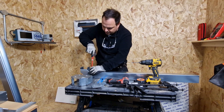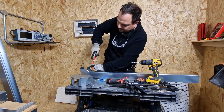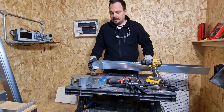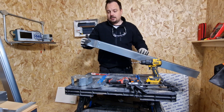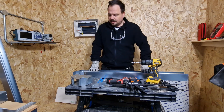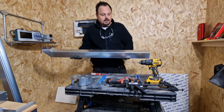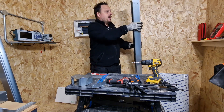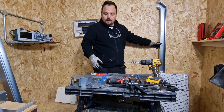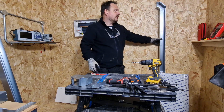So you can see there we've got the 90-degree on there with the bending radius that's a little bit kinder for us, and that can help us form the next bit of containment on the wall. At the other end, when we come to cut this off — because this is going to be a vertical leg down the side of the distribution board — we're going to have to make a cut at the bottom so we can put our fitting on to then swoop underneath.